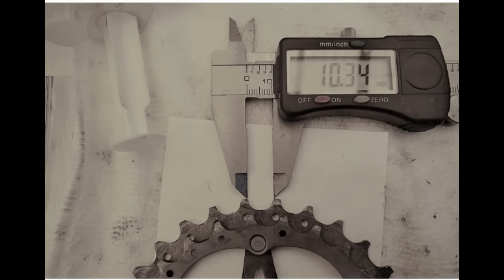Here is a very worn cog. The tip-to-tip measure on pretty much all Shimano and SRAM cassettes — measuring from the trailing tip to the leading tip on the cassette teeth — pick the squared teeth. You can see this tooth here is rounded; that is a shift ramp tooth with a profile to aid shifting. Don't try to measure to that because it's difficult to get the tip. Use the normal profile teeth for your measurement.